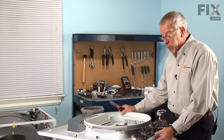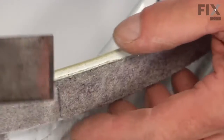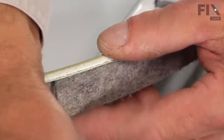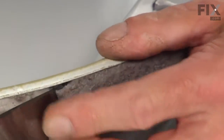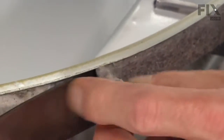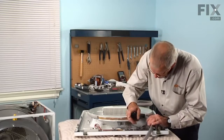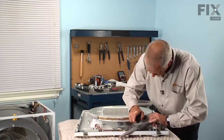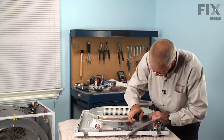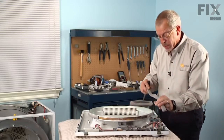Now that we have the front panel on a suitable work surface, we're going to take our putty knife and start on one end of the felt. Get the putty knife in under the edge of the felt and start scraping it up. Once we've got the old felt off, we'll then use our wire brush to clean up the surface. Once we get to the end, just carefully peel that off without disturbing the lower felt. We can discard the old felt.